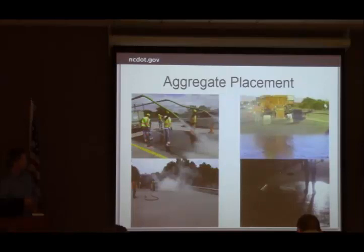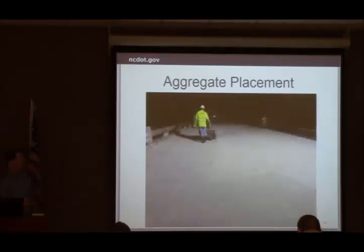These are mechanical placements — there's a worker with a shovel spreading aggregate. You're broadcasting to refusal, meaning you put excess aggregate on until it's completely filled, and then you can see they've got to sweep the excess off — vacuum or broom it clean. That's the first layer, and remember this is a two-layer system. Once the first layer sets up, you sweep all the excess aggregate off and get ready for your second layer.